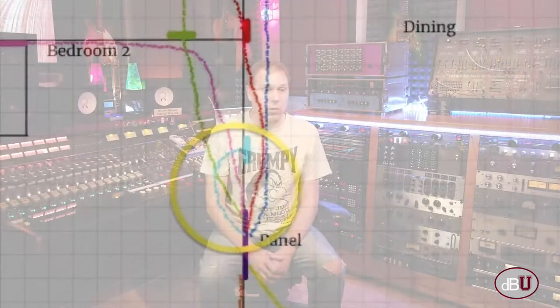It was a solitary isolated ground. To do this though requires more wire, breakers, and more labor. It's nowhere near as efficient as daisy chaining, but for studios and hospitals, it's a standard. Some higher end places might use balanced power, which is really cool, but far too complicated to dig into here.